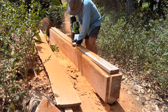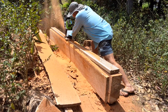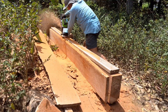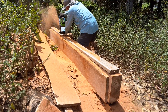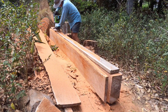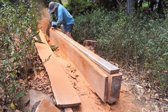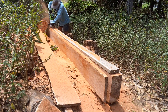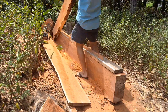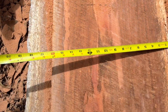This kind of cut is hard even for a powerful gas saw, and it's a torture test for lithium batteries to put out large amounts of current continuously without resting. Battery saws have always been great for bucking out logs where you pause a bit between each cut, but until recently they struggled to do long continuous cuts. I do swap batteries once during this big cut — not because the battery has run out, but simply to spread the work among the four batteries I brought to the log. That is a heavy slab — and check its size: 13 inches of heartwood.